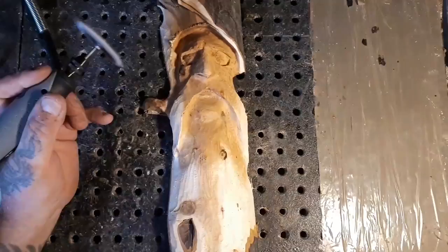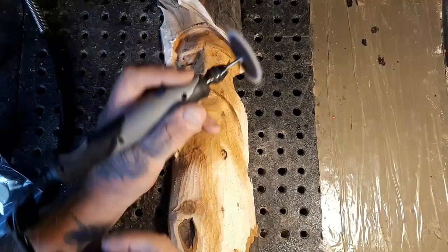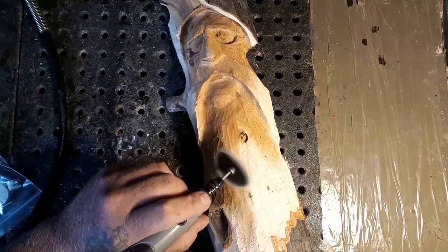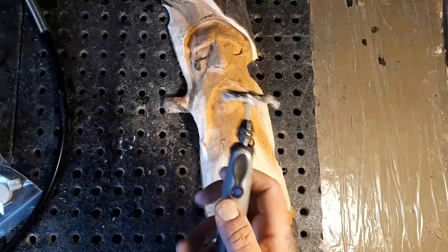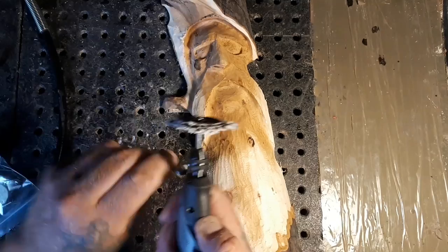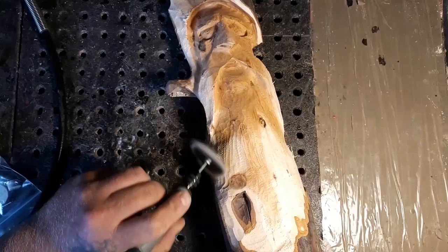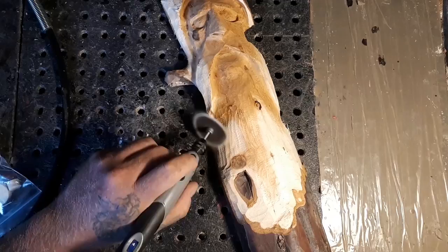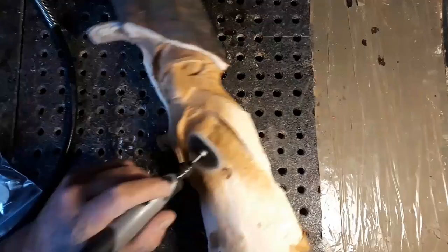To practice sanding and see how it works, I've got this piece of wood that I carved out with my bits and haven't finished - I haven't finished the beard here yet. Let's turn it to a speed I think is going to be good. Let's try sanding. Hold on - power off. I'm going to lock it up again and give the collet an extra bit of tightening with the wrench. Let's turn it on again.